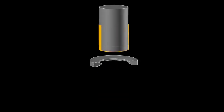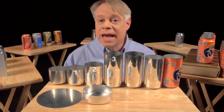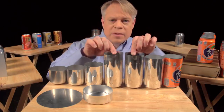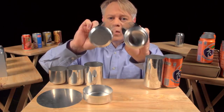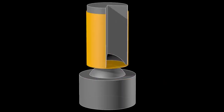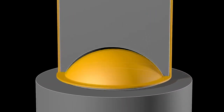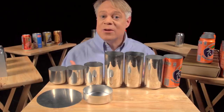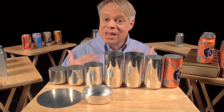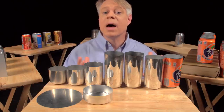If we watch this process up close, you see the initial thick wall, and then the thinner wall after it's ironed. Ironing occurs in three stages, each progressively making the walls thinner and the can taller. After the cup is ironed, the dome on the bottom is formed. This requires a convex doming tool and a punch with a matching concave indentation. As the punch presses the cup downward into the doming tool, the cup bottom deforms into a dome. That dome reduces the amount of metal needed to manufacture the can — the dome bottom uses less material than if the bottom were flat.